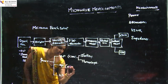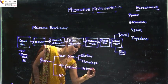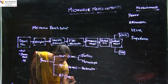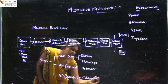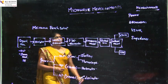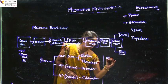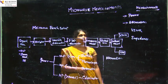For medium power, which has a power less than 10 milliwatt, we use a bolometer. A bolometer is a microwave device used for measuring medium power. If you have a high power signal greater than 10 milliwatt, we use a technique called the calorimeter. There is only one method for measuring attenuation in the syllabus — using the bench setup to measure how attenuation is obtained.